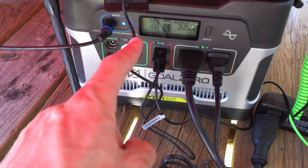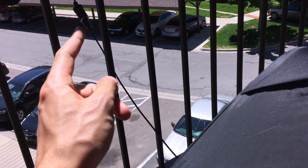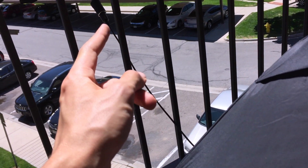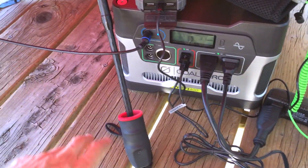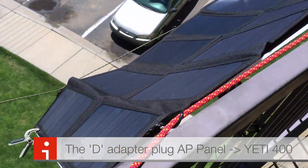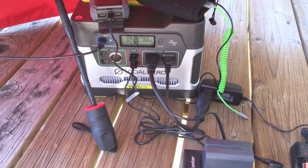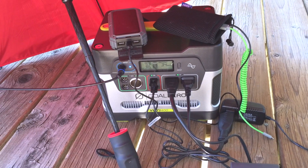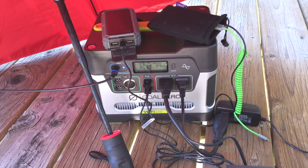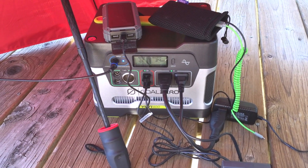The input from the solar panel uses a cable that's about $9 — basically a male cigarette lighter adapter — and you also need to buy a female connector for about $6 to $9 after shipping. Someone in the reviews noted that straight out of the box, the All Powers panel can work with the Yeti using the included jack. With both cable options and the photography silver reflector, I was able to get it up to 35 watts — just past 50% of the max advertised wattage.